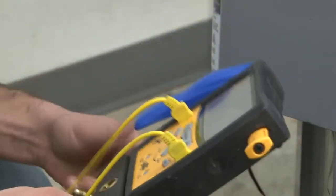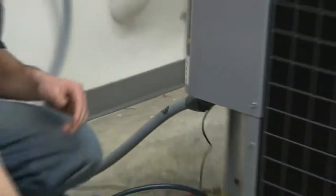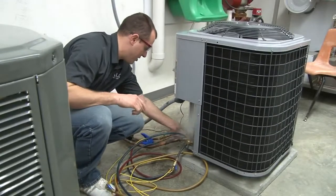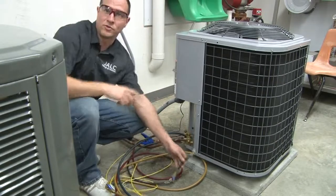I'm going to shut my gauges off, bolt them closed, and simply unhook my manifold gauges — and I lose very little refrigerant charge.